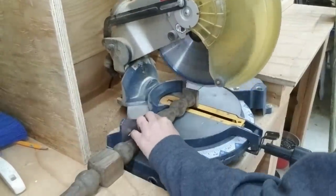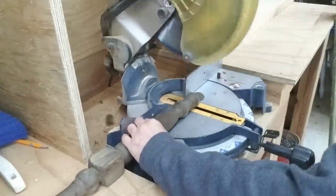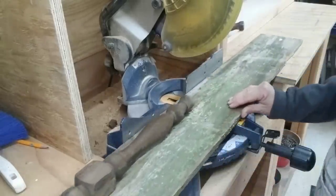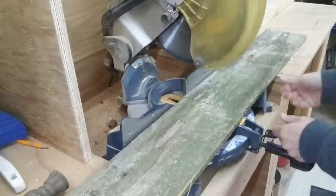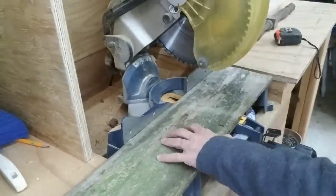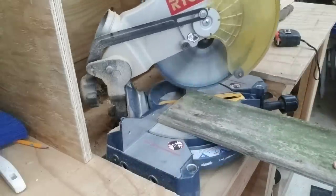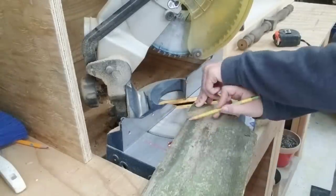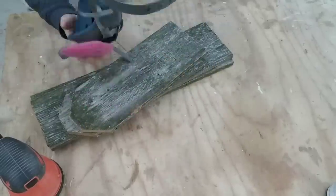The first thing I'm going to do is trim the edges of the spindle — the edges were a little rough so I want a smooth surface to attach to my piece. Next I'm going to cut a piece of fence board the same size as my spindle — you want it to be the exact same size, so I'm using the spindle to measure. Cut two pieces like this, then cut the side pieces. I want it to be 16 inches, but that's personal preference. Then I'm going to turn my miter saw to 45 degrees and cut some little dog ears on it.